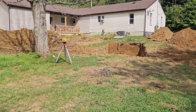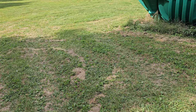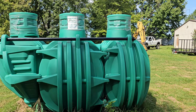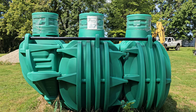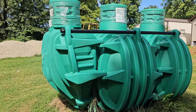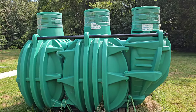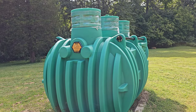I'll give you an idea of what the new septic tanks look like. They come in a couple different styles — concrete and plastic. This septic tank here is a Norweco 960 aerator and it's a plastic tank. It comes in: the first compartment goes into the second compartment where it has a motor that aerates it, kind of like a washing machine, and in the final chamber it has a filter where it goes out. That's what the new style septics look like. That tank there weighs about eight or nine hundred pounds, so it's not real heavy, but they're really good tanks.